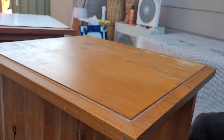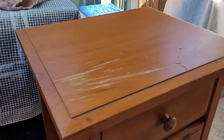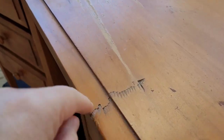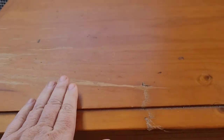It's got a fair bit of damage but that's just on the finish, so that's not really an issue. Let's have a look at the back. It's solid wood — it may be that this piece here is a veneer piece, not really any way of knowing, doesn't really matter. It looks like it's solid wood everywhere, there's paneling on the back. A little bit of mildew on there so it needs a good clean. On this one there's been a bit of damage, or it's been hit. I could probably sand it out but there's a risk that it is veneer, and if it is veneer then I'm just going to end up sanding through.